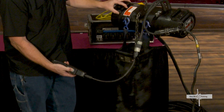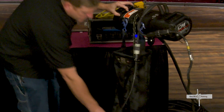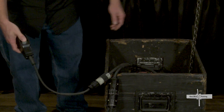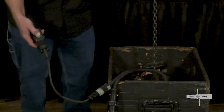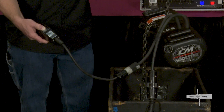It is also a good practice to run each hoist in both directions — up and down — as it comes out of the travel case and floats in preparation for its assigned task. If you have a controller or cabling problem that prevents the motor from coming back down, best to find out during the load in instead of in the midst of a load out. Depending on how much chain is in the air versus how much chain is left in the road case, you may need to run a fair amount of chain through the hoist before it will float. Care should be taken to make sure the chain is running cleanly through the hoist with no knots or twists in the chain.